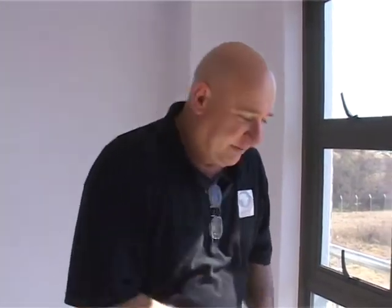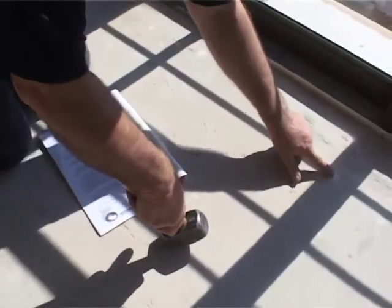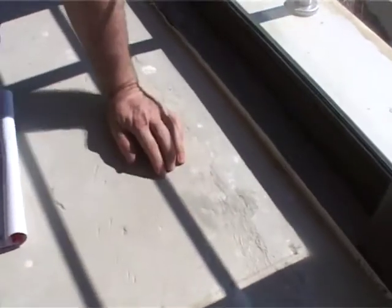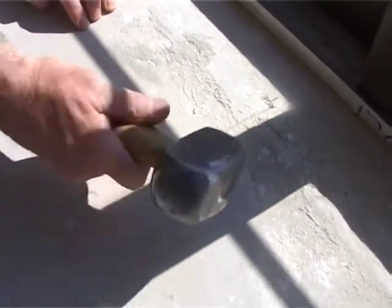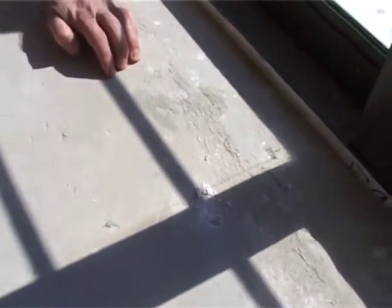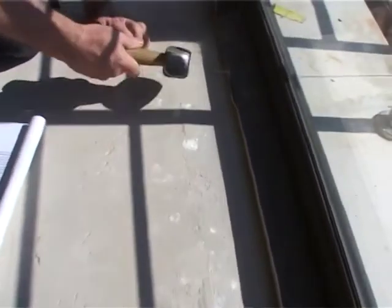We're in another room now, and here we're going to do a small bit of patchwork. We don't need to do a full screed like we're doing in that room. This room's just got one little area by the door which is dipping down, so we need to level that. Two things I want to show you. During the building process, there are little spots of cement that people have dropped. You really, guys, must clean your screeds properly. Gift, where's that broom? Just come and sweep here. All these little lumps must come out. So we'll give those a sweep, but that's what you've got to do.